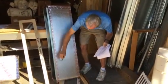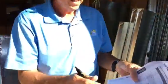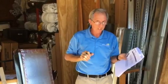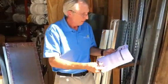One important note about the return filter: there are no filters in these linear diffusers. We usually put a five-inch filter media system in the air handler itself, so the return filter is at the equipment.